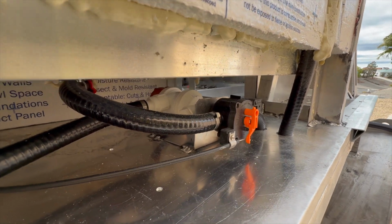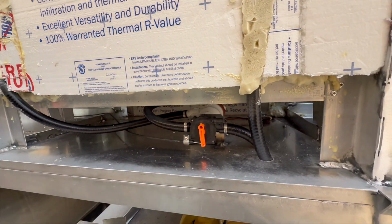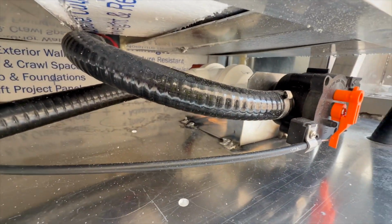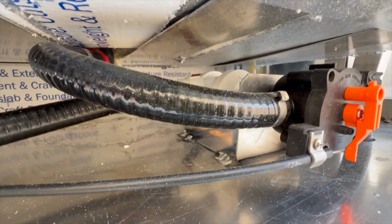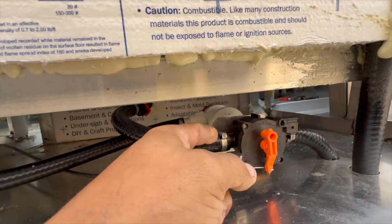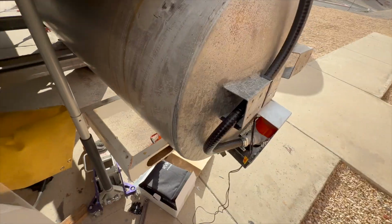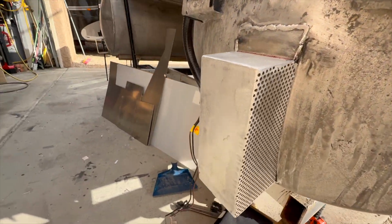Anyways, this is the recirc pump. Now it's on a version 3 live well valve, but only the drain and recirc will work. The auto won't work, which is why we have that pump down there at the bottom of the pontoon, because there's no way you can suck water from the pump up here and the hose all the way down there. It'll never work. So we had to have a pump all the way down at the pontoon to pull that off.